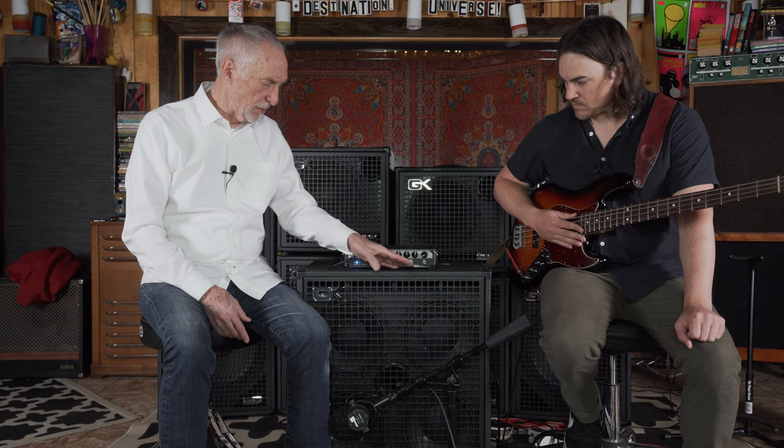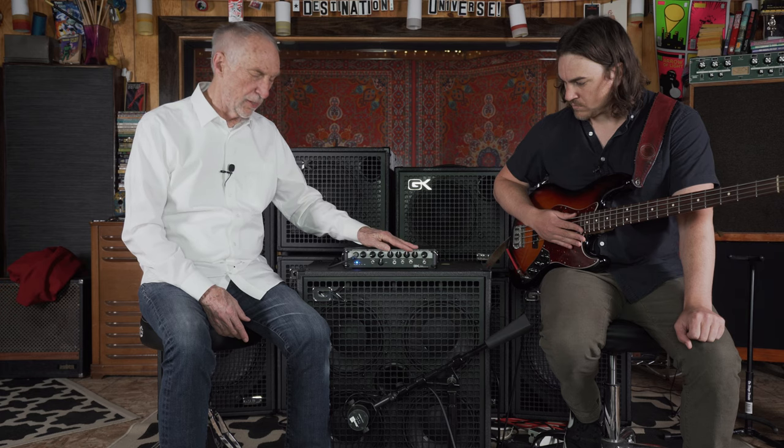When you set up one of these amplifiers, there's three or four things that you should do, and do it in the proper order. The first and the most important thing is setting up the trim control. You start with the EQ flat, by the way, and all the voicing filters off. Then you set the trim, which adjusts your input, matches it to your bass. Then you set the voicing filters, then you do the EQ, and then you can start working with the amp,